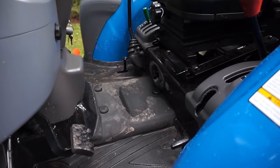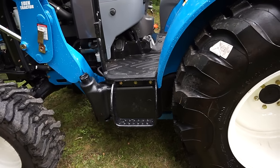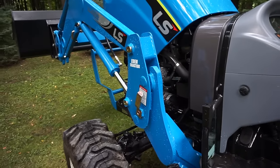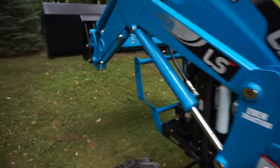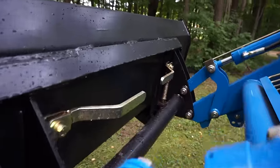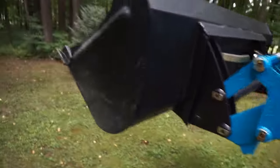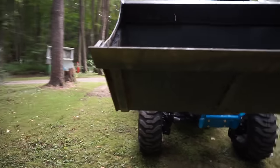The fuel tank is down below, which is nice — you don't have to go up on top of the hood like on our older tractors. The front-end loader does come off entirely; you can see where it fits into a slot. We probably won't take it off, but the bucket is designed to be skid-steer adaptable — you pull two levers, pop the bucket off, and put a skid-steer attachment on. So getting pallet forks is one obvious accessory.